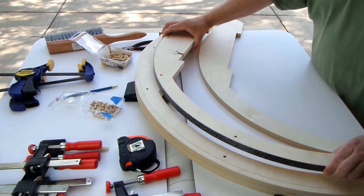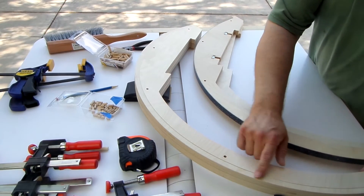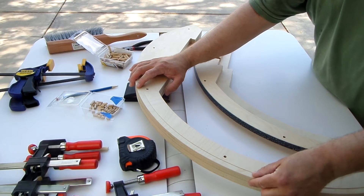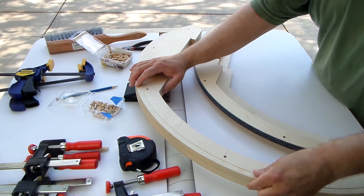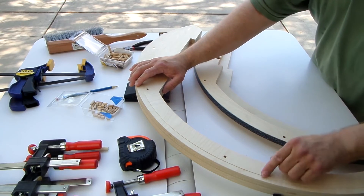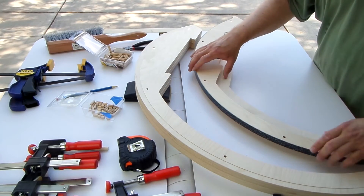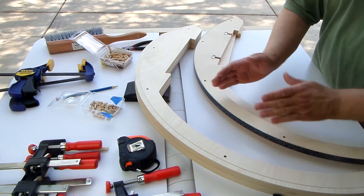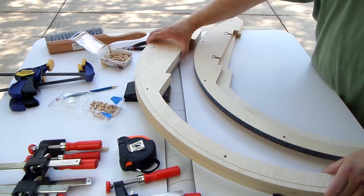On this next layer, in addition to the holes, I put a really thin recessed area which the CNC machine takes off — only about 11 thousandths of an inch. That gives me a little inset so the wooden part of the bearing support can get in there without rubbing. Otherwise you'd have two pieces separated by a three-quarter-inch piece, and the three-quarter-inch piece wouldn't be able to easily go up inside there.